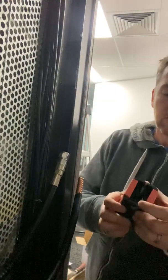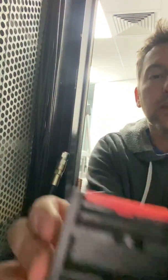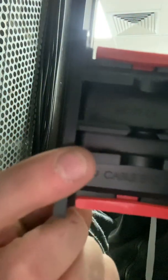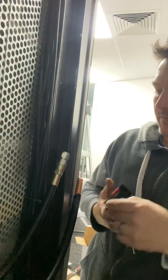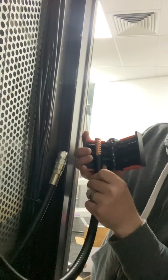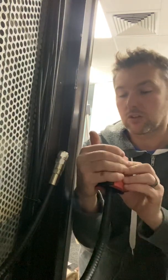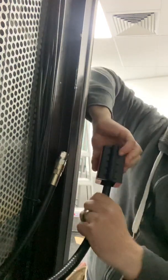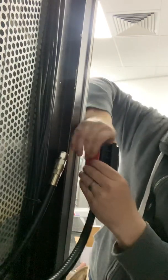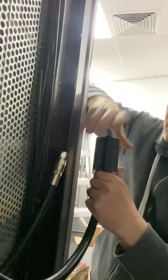Get that manual prep tool — it actually tells you which direction the cable end is. This cable end has an arrow facing up, so pop that in there. When you close it up, don't let go of it at all. Once you close it, don't let the pressure go because you'll end up with a jagged cut. At first it's actually a bit hard, and then as you spin you'll feel it let go — that's when you know you're through.